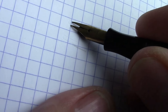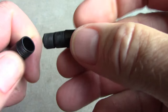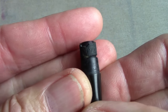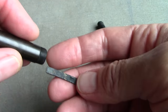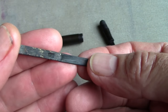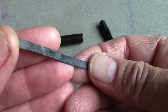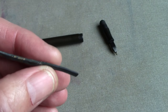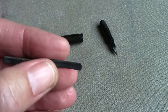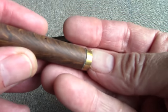The reason I thought this pen would meet the requirements is that with very little pressure you get a lot of flex in that nib. The next thing I do with a barrel like this when I'm looking at doing a restore is I see how easy it is to pull off the section — and this one came out very easily. You can see the rubber sack still attached to the base of the section. When I opened it up, the old hardened rubber sack came out, and also the lever wire came out. I like to clean off all the crud and corrosion that this bar has accumulated — it's pretty much a brass or steel that cleans up to a silvery color.